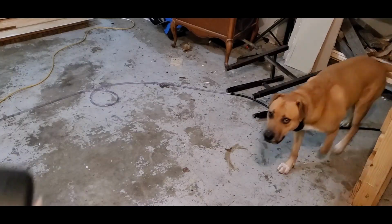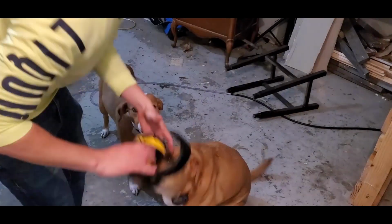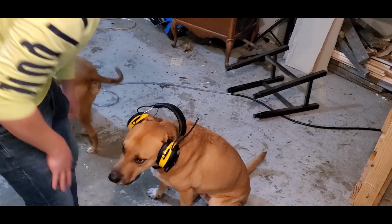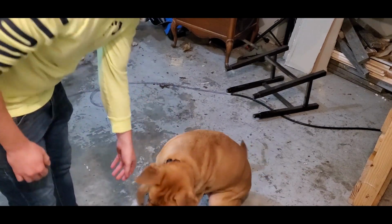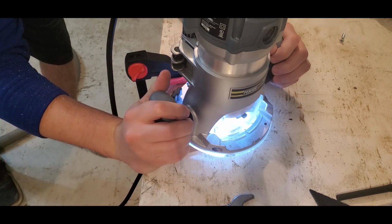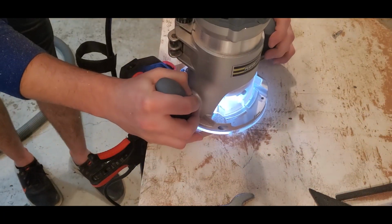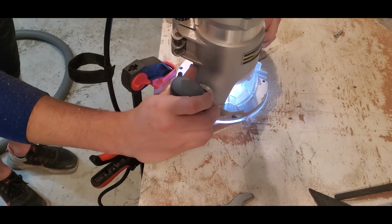Now I've made sure we have all the proper safety equipment before using our power tools. To remove all the material, I'm using a straight router bit set to a depth of 1/2 inch. All material and equipment used in this project will be down in the description below.